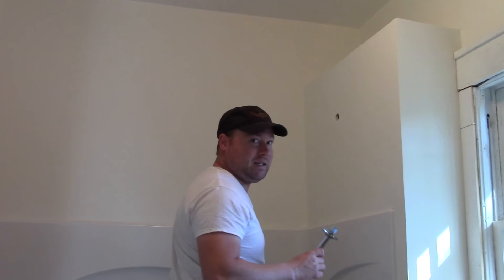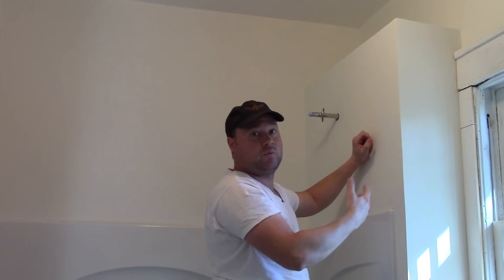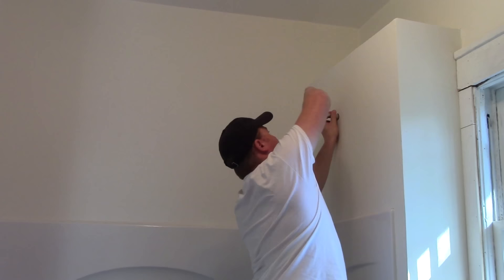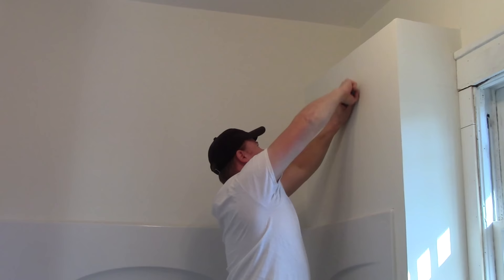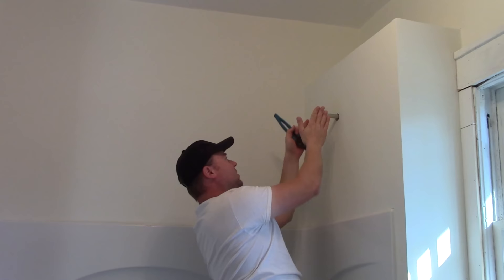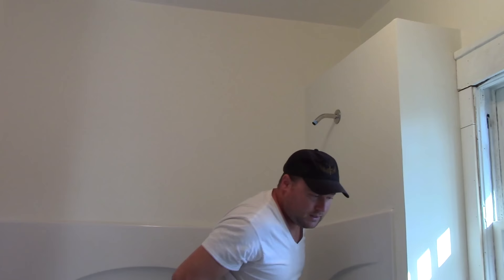I'm balancing on the edge of the tub — no safety comments needed. Give yourself some room on the trim plate when putting this in because the edges can catch you and give you cuts like deep paper cuts. Keep the pliers tight up against the wall so any scratches on the pipe are hidden by the trim plate. Make sure it's square and coming down the center of the tub. There are no visible scratches — they're very close to the edge but not showing.